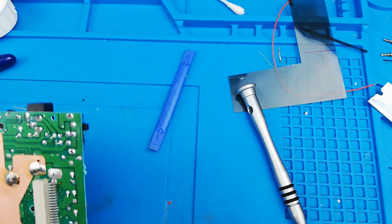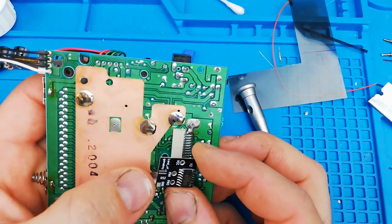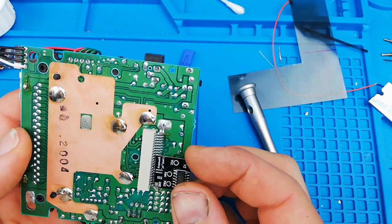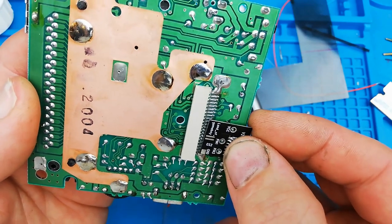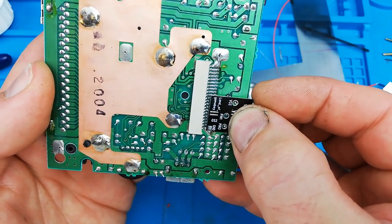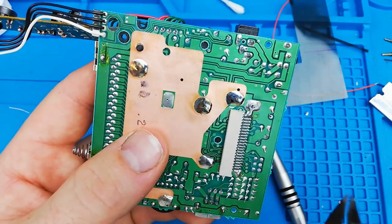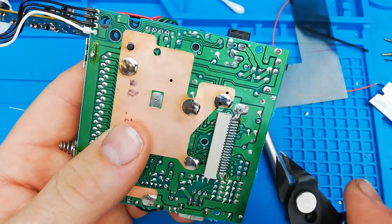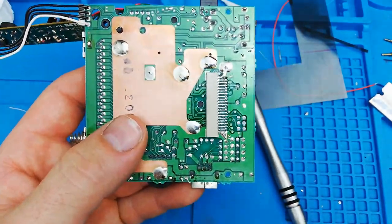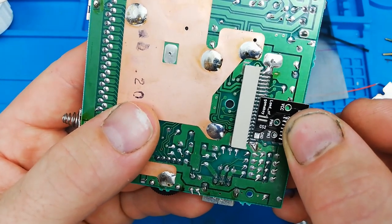Time for the bivert chip. When they are on an integrated circuit board like this it makes it so easy because all you have to do is just line it up to the right place. You'll see there are two small pads — they line up to pins six and seven on this connector. If you get it in the right place you'll see it also lines up to some other pads. We literally lift pins six and seven for this to slide under, and then we just pump the rest full of solder. The best thing to do is also trim all the ends of the legs in the surrounding area because they do stick up the back and you don't want any shorts — you also want it to sit flat.